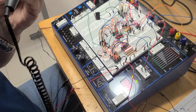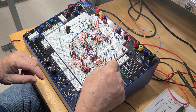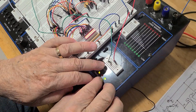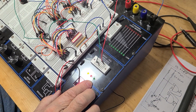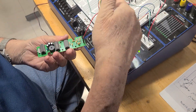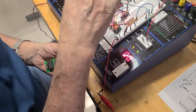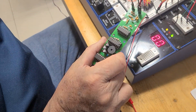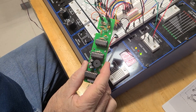Another probe is embedded in the trainer. Using the red wire I'm monitoring the reset of the counter. You can see the same three lights: one for pulses, one for high, one for low. The reset is low; when I press the button it goes high. Our DIY project probe also takes energy from the circuit. A lower frequency sound means low, and a higher frequency means high. This probe has only audio indication — no optical display.